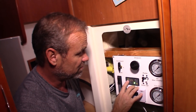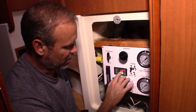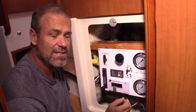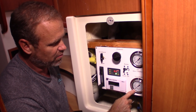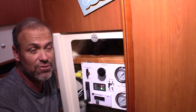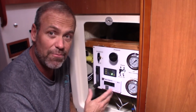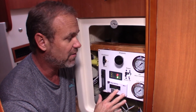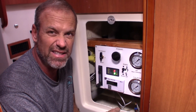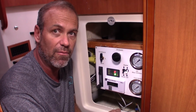This is my freshwater flush monitor. I can set it to minutes or days. Now it'll come on for 11 seconds and be off for zero seconds, but what we actually set it at is it comes on for 20 minutes and then it's off for five days. What that's doing is taking the pressure pump and fresh water from our tank and flushing it through the membrane — keeping our membrane fresh so it doesn't get clogged with overgrowth. I'd be glad to demonstrate it, however you cannot run this system in dirty water or it will clog our pre-filters and membrane within less than 15 minutes. We need to be at least a couple miles offshore in really clean, clear water before we can start running.